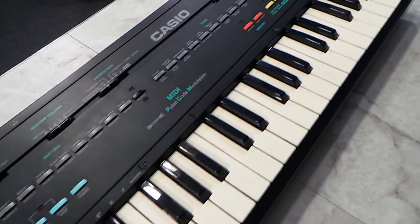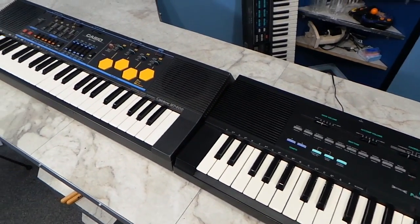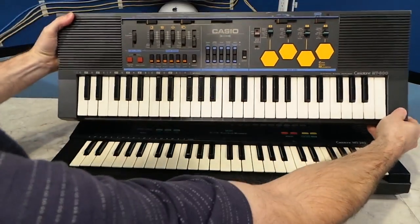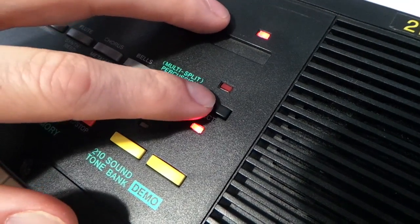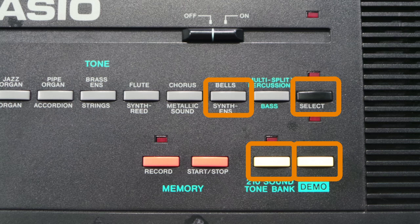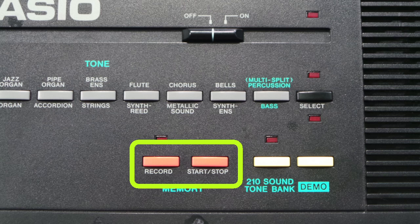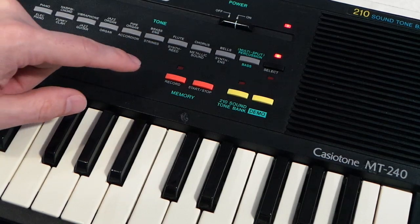So everything is put back together again and other than the super glue residue, it actually looks pretty good. This keyboard has a very similar case design as the Super Drums keyboards made a year or two earlier, and the keys are identical on them. The select button is now working. So, these four keys were initially broken — the jumper wire I installed fixed these three. However, it left this one forever broken since I couldn't get solder to stick to it. But it occurred to me that I would never use these buttons here, so I redirected a single wire that ended up duplicating the function of these two buttons on these two buttons. Now I can press the record key to get access to the bells or the synth instrument.